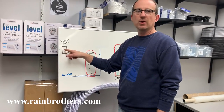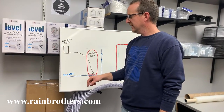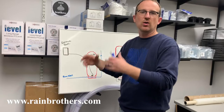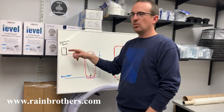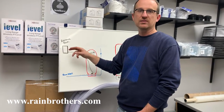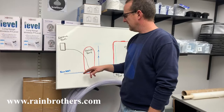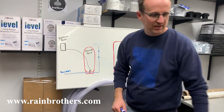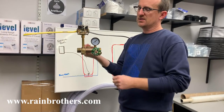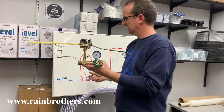You're going to want to turn off the breaker to the well pump in your electrical panel — hopefully it's labeled. Then open your drain valves in your house to drain out all the water pressure in the system. Also, if you have an electric hot water tank, turn off the circuit to it so the heating element doesn't blow. Look at the pressure gauge on your pressure tank and make sure it reads zero. Once it does, open up the boiler drain on the front of your tank T to drain out any remaining pressure in the pressure tank system.